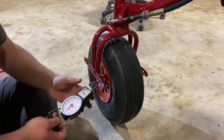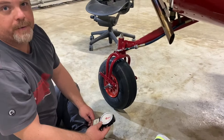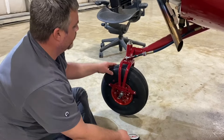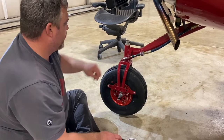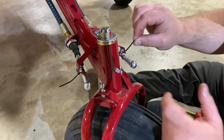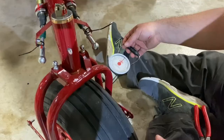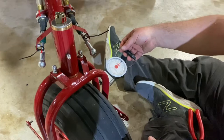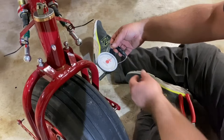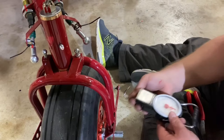What we found to be optimum when we do our inspections is between eight to ten pounds. To get there we must pull our cotter pin out, pull our nut off, and insert a shim under the nut. To help keep the cable out of the way, use cable ties or wire ties through the rivnut of the bracket so the cable is free and you don't have to hold it with your hands. Measuring again with the cable held aside, it's actually about one to two pounds — so our target of eight to ten pounds requires a meaningful shim.